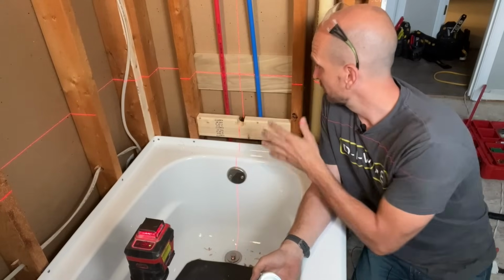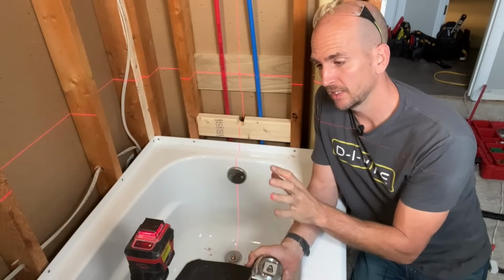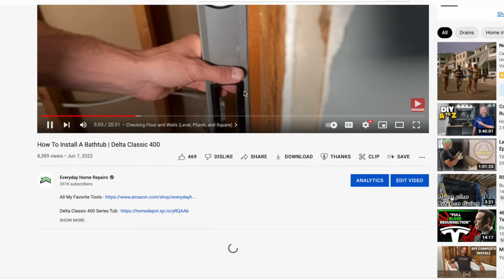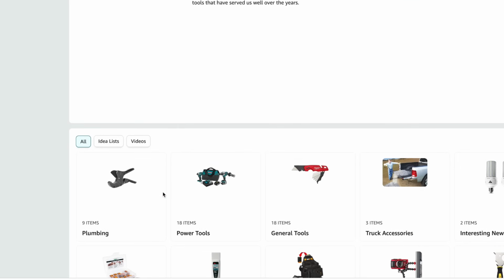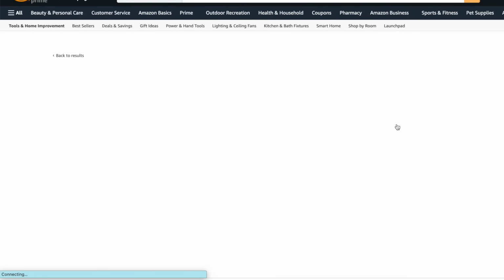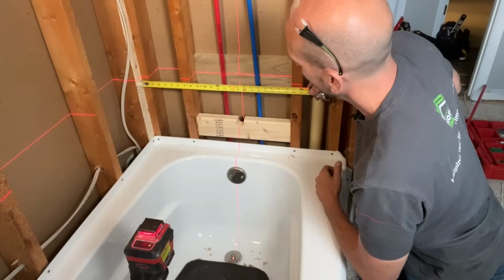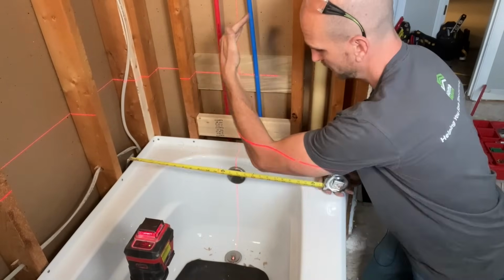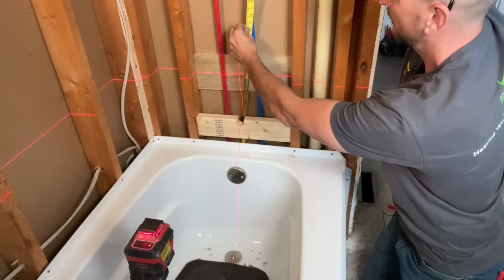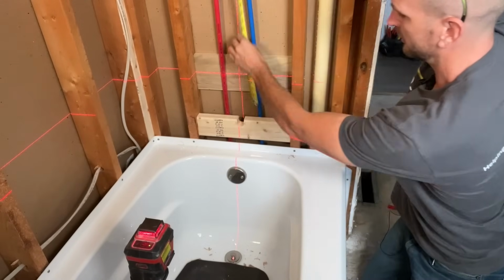So now I'm ready to start mounting, and I'm using a laser. Now, if you don't have a laser, depending on how many different projects you're doing around the house, these can be extremely handy and honestly only cost about $90. You can look down in the link in the description to my Amazon store, and this exact laser I have as the recommended laser for DIYers because the cost isn't too high, but it does all the features we need, such as this. So what I'm doing here is I've just set the vertical laser at 14.5, which will line me up perfectly with my overflow and my drain. And then also the cross laser is at 28.5, which gets me 30 inches off the floor.